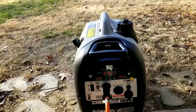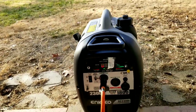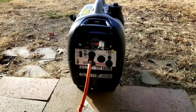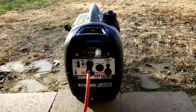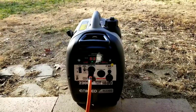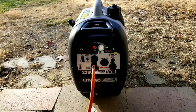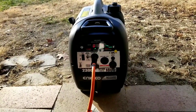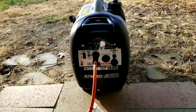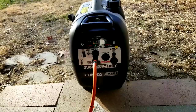I did want to check to make sure that power meter worked, because I was thinking, okay, it is drawing, but it's not showing anything at all. So I hooked up my angle grinder to it, and sure enough, it drew some power, because it has 11,000 RPMs, and I just put it at full power and let it run for a minute, and you can see the meter going. But as far as the fridge goes, surge watts, it's going to be 1,000 at best. Running watts is 350 on the LG, but it's barely making a dent even on econo mode. So there you go. All right, thanks for watching.